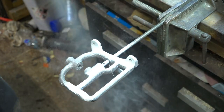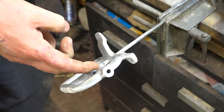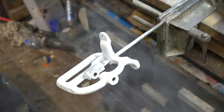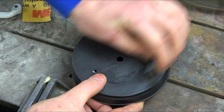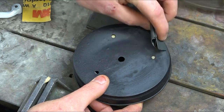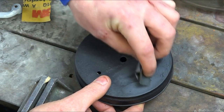Another thing to remember when you're painting in cold conditions is that the catalysts, which make the paint harden and dry, slow down a lot in colder conditions. It's always best to try and keep your area as warm as possible — it'll speed up your drying times considerably. The filler primer comes out really nice, gives you a nice smooth finish, especially if you're working with something that's a bit rough. For something that's 100 years old, we've got it pretty flat.